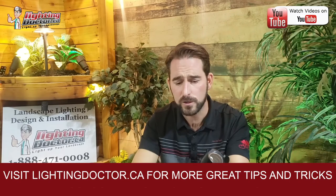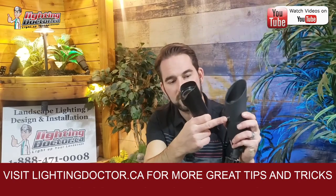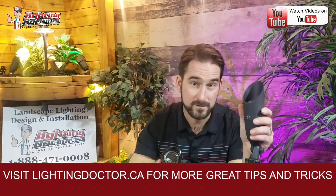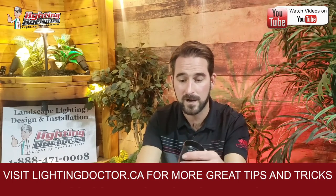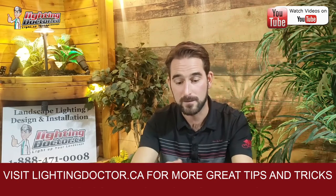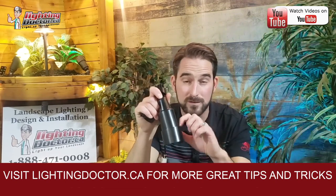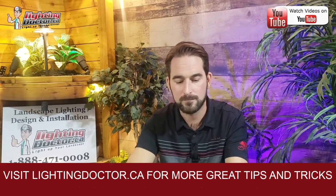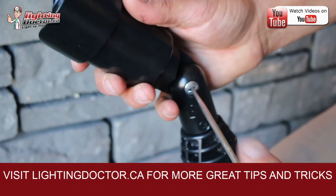Super easy to adjust. The other thing I like is there's no tiny little Allen key piece to secure the top of the fixture — that's a pain in the butt when it's been there for a while and gets covered in dirt. This one you basically just twist it off. And if you get the trial light, you'll see how well that actually sits on there — super easy and super watertight because of that water seal. There's also a super easy, adjustable set screw — just a regular Phillips screwdriver — and you can loosen that off and adjust this however you need it to be.